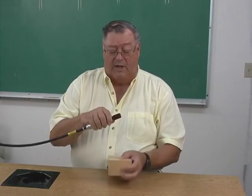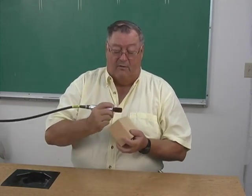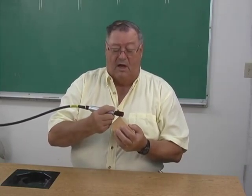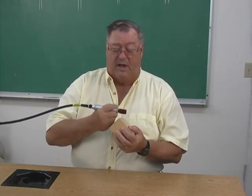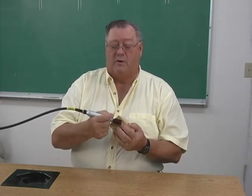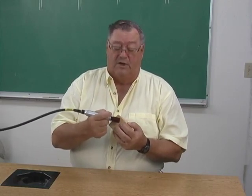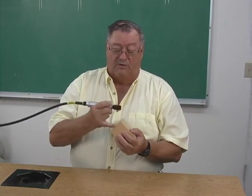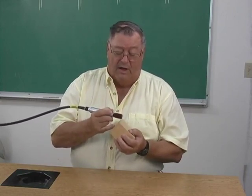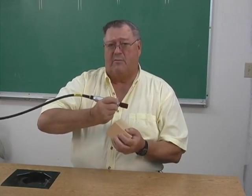Now, if I'm holding the handpiece in a pencil grip, the same thing applies. I don't want to be wiping back and forth like this, because eventually the rotation of the bit and hand fatigue or whatever may carry that bit over the end of the wood, and if it does, look what's there. My fingers are going to suffer for it. So even with a pencil grip, I will drop my finger as a control, a fulcrum, whatever you'd like to call it. Now look where, if I don't use it, the control is clear out to my elbow again.